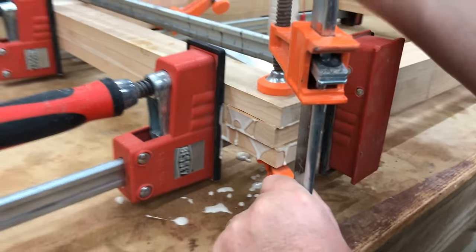And that would wrap up phase 2 of the build, where we added cabinets to our base leg unit. And once we put the torsion box top on that, we have still a fully functional assembly table, but we've added some increased storage to it at this point. You could put some cabinet doors on it, or you could put a couple of shelves in and leave it open. The option is yours, up until the point maybe down the road where you decide to go full blown and add the drawers and finish it out fully.